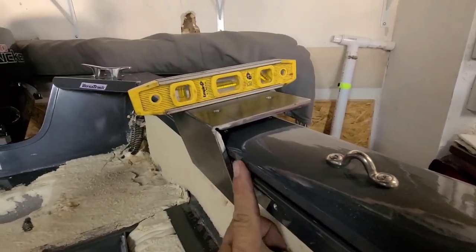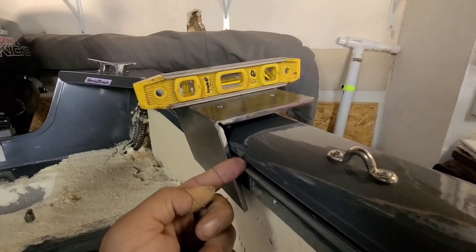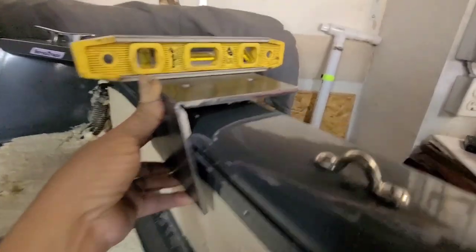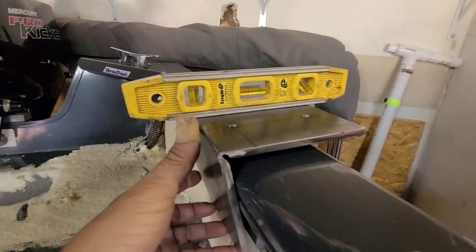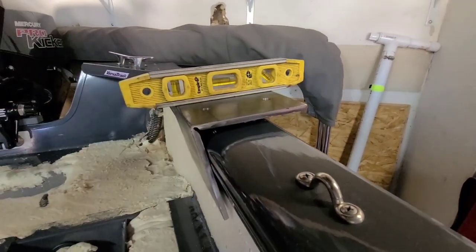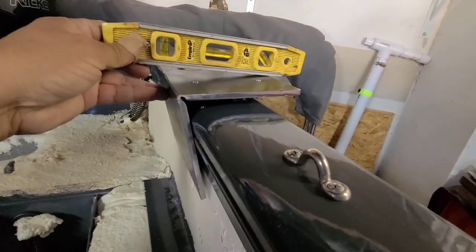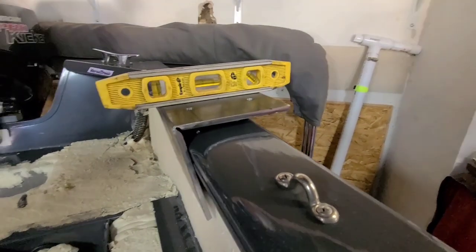There's a flat surface area right here where this bracket is sitting flush, where the bolt is going to go through the Versatrac. I've bent it a lot already, but I'm going to lay it flat. Let's pretend it's bolted on right now — the level is still not at center yet. The whole idea is to get this surface area to sit truly flat like the boat. The boat is sitting true flat right now because I put an indicator onto my transducer in the back. I still have several degrees to bend this plate to get it to center.